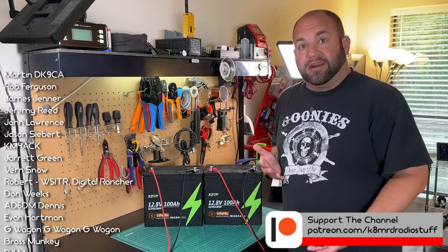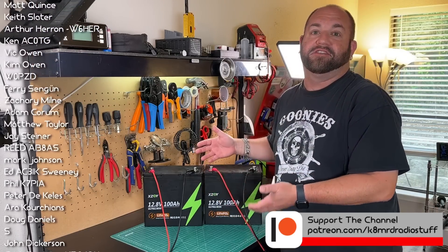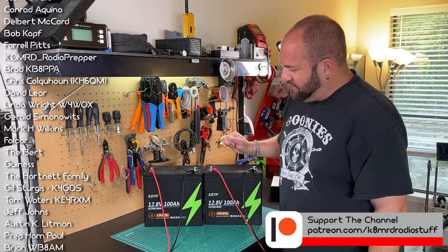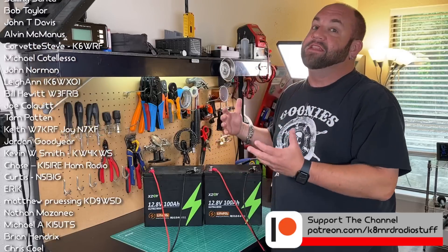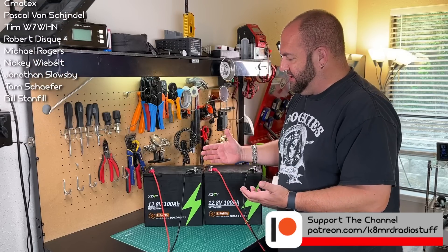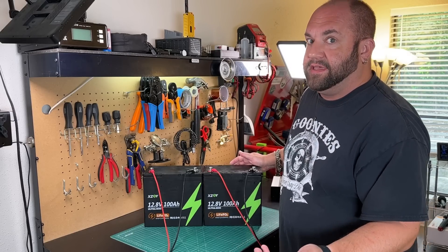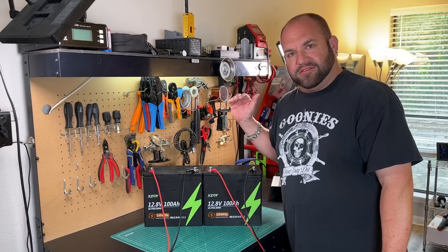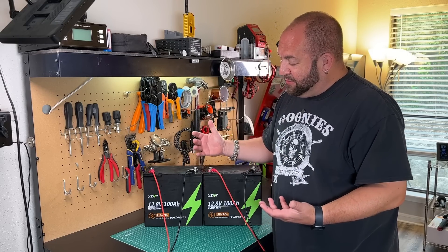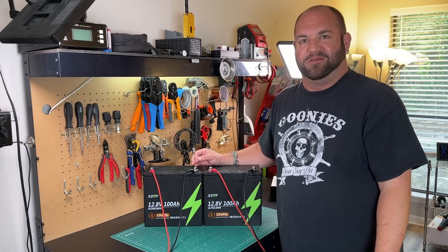Technically, these batteries have passed just about every test we've thrown at them. A little concerning — we needed to get up to about 275 amps before the overcurrent protection kicked on, and they did get a little warm, about 120–130 degrees on the case top after only a couple minutes. But they do the job. I would definitely recommend having inline fuses or breakers for protection — don't just rely on the internal BMS to shut off. Even at 130–150 amps it wasn't shutting off. For $165 after tax for these tiny mini batteries, it's kind of hard to beat. Let me know what you think. My name is Mike Cade at MRD — thanks for watching Ham Radio Tube. 73.